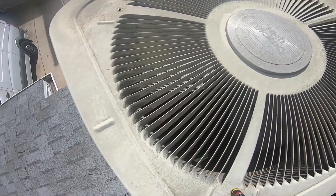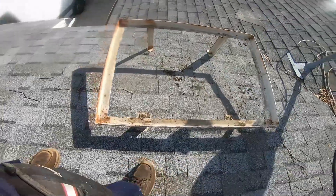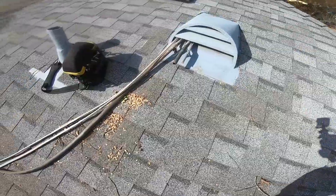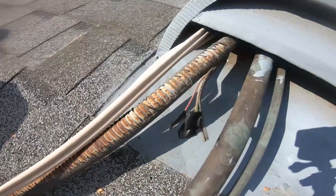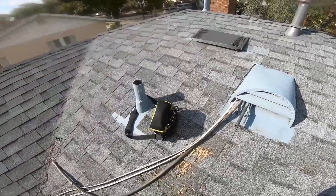This is a very steady, very strong curb so we're gonna keep that. I'm just gonna put some treated lumber or some angle iron — I haven't decided yet — in between to hold the new unit. The copper comes out of there. This electrical I'm gonna have to replace because it's not the correct gauge, and that low voltage wiring was really old and brittle, so it's no good. I'm gonna go in the attic and get rid of that evaporator coil and supply plenum.